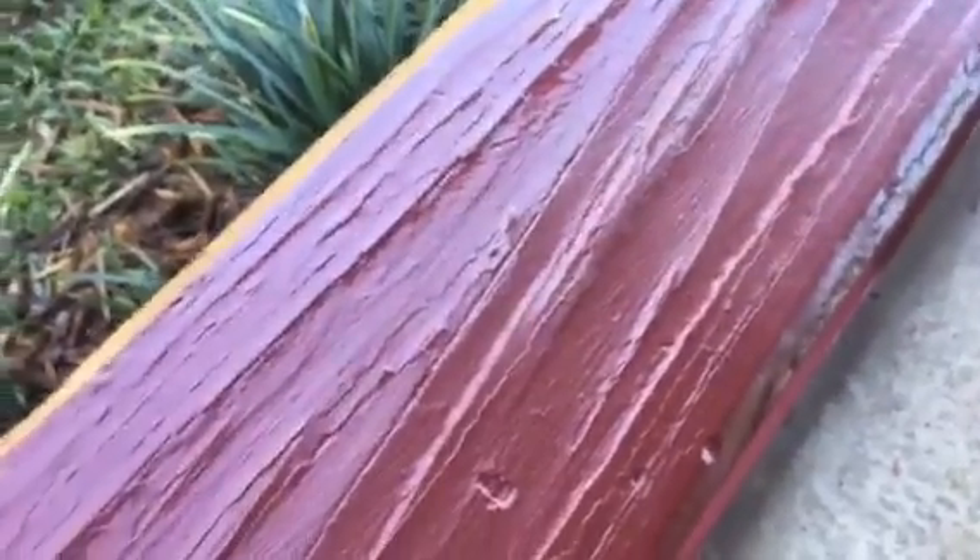Now this is one of the things I'm really proud of on this job — this patio cover. Please take the time to go back and watch our videos from the preparation on this job. You'll see that there is a ton of primer in areas like this. My goal is to actually make this patio cover look good for 10 years or longer. We power washed — extreme power washing — all kinds of mold and growth off of this patio cover. We primed, primed and primed it, especially in these areas. These have been primed two and three and four times, sanded down multiple times, and you can see a huge difference compared to what we had before.